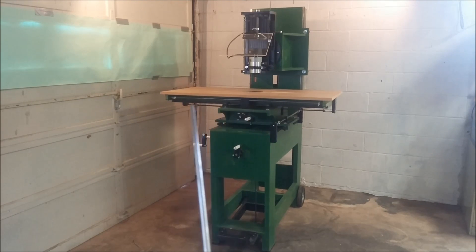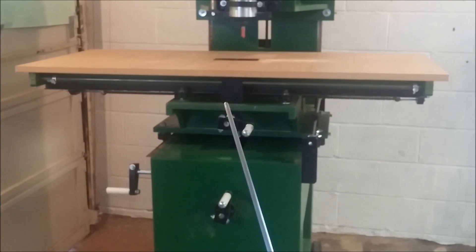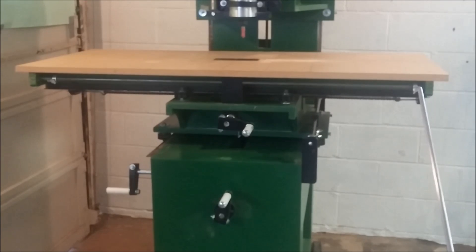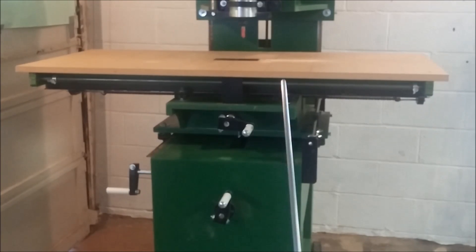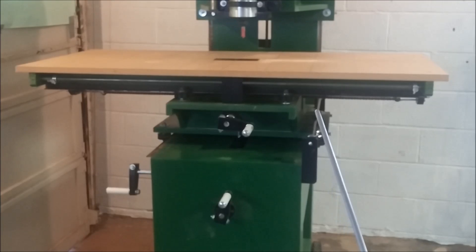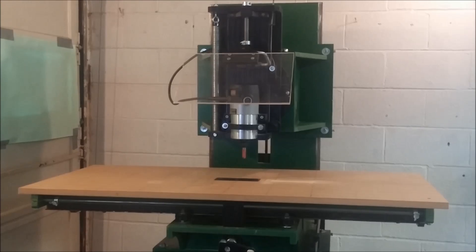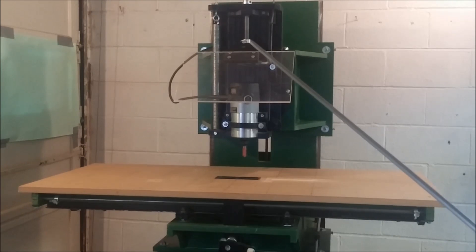So I have stop blocks. Here's the block — it runs in a half-inch shaft. It's a half-inch rod that goes through a block right here, and I've got collar stops on each side. They just have a thumb screw on them so you can slide them to any position to stop the table where you want it. I also have it on the forward and backward movement. And I've got a stop up here on this for the plunge feature as well.